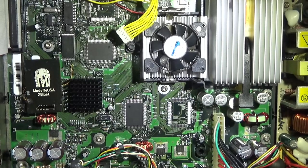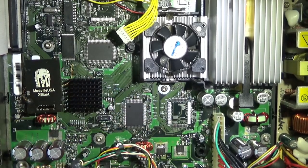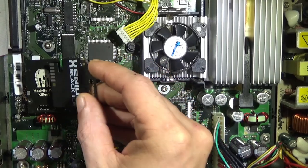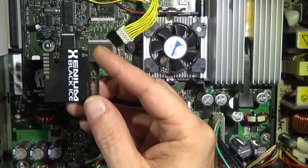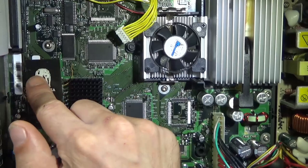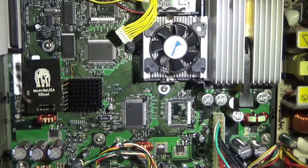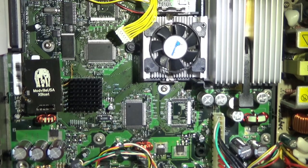Real quick, on differences between an Xblast Modchip and a Xenium one. They're pretty equal, but in my opinion there's one really big strength of an Xblast Modchip, and one really big strength of the Xenium. With the Xblast, you can install RAM chips one at a time and they will still boot. Xblast has a built-in RAM test ability. Fantastic. Always have one of these around if you do RAM upgrades, because it makes troubleshooting those much easier.